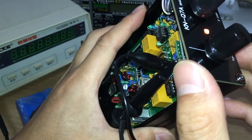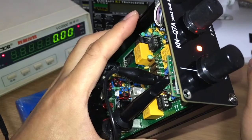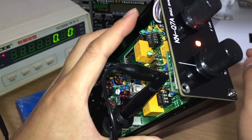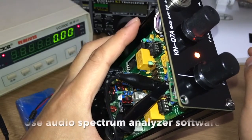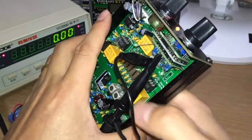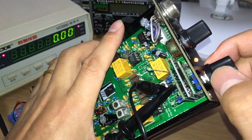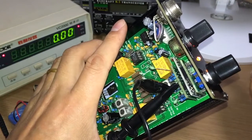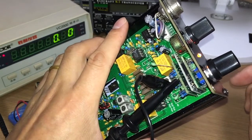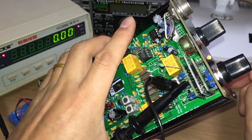If you change it to BFO calibration, you can tune the BFO. This is very similar to the way you tune the KNQ7A BFO. You can use an audio spectrum analyzer software — connect it to the speaker output here and then connect the other side to the microphone input. Turn the knob a little and watch the spectrum: if the audio output falls in the range of 300 Hz to 3000 Hz, it should be good.